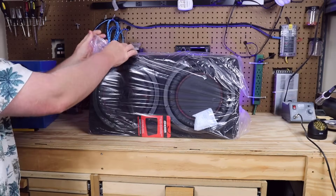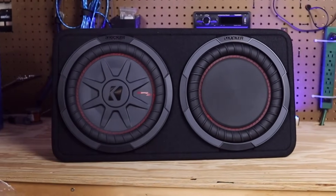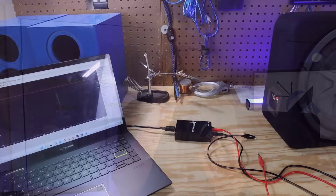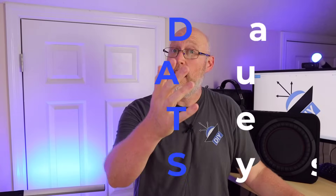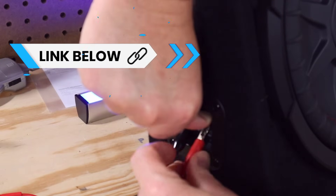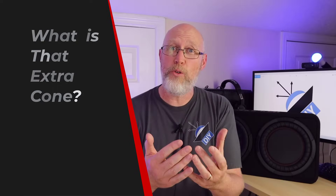Of course it is wrapped in plastic to protect it from moisture damage during shipping. Whenever I review something like this, I always like to include some hard data. So I'm going to grab my laptop and my DATS and run a sweep on this thing to try to find the tuning frequency. If you build your own speakers, I strongly recommend you pick up a DATS — I'll give you a link in the video description. What the DATS does is it runs an impedance sweep and gives you a plot, and the first thing I notice is that this plot looks pretty much like what you'd expect for a ported enclosure.